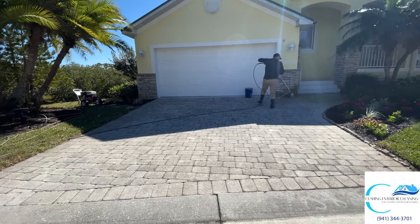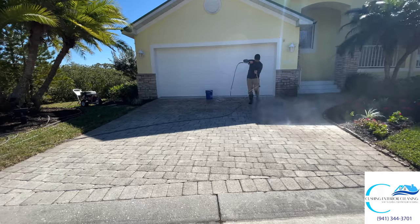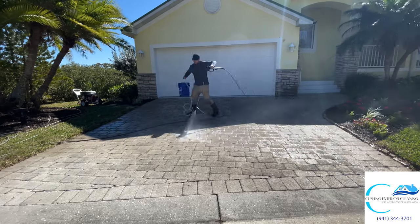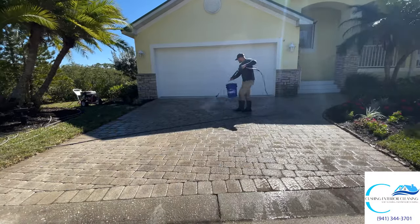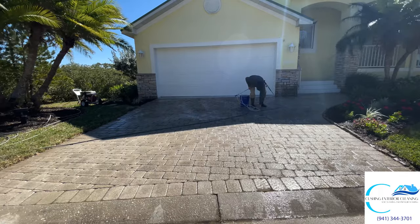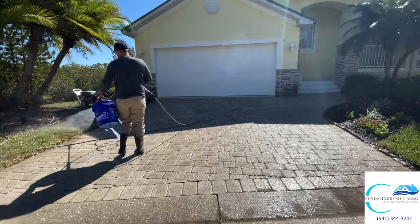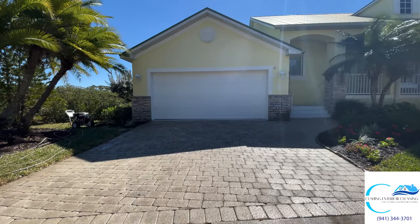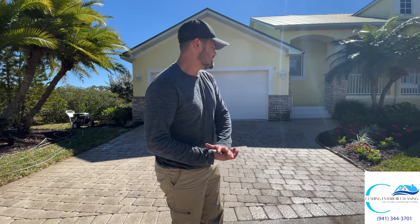What is up, YouTube? Welcome back to another video. This is Eamon Cushing with Cushing Exterior Cleaning. Right here I'm spraying my sodium hypochlorite mixture down. I've got it at about a 50-50 mix, so coming out of the X-Jet we're probably running about a 1% sodium hypochlorite mixture. I'm also watering the plants — I don't want to kill anything here. We're going to let the solution sit for about 10 minutes. We don't want it to dry or else it'll start to oxidize, especially on the walls. So we'll let it dwell for about 10 minutes to kill the mold and algae, then hit it with a surface cleaner.